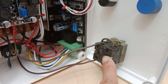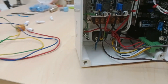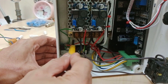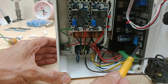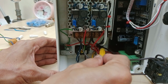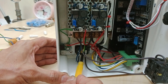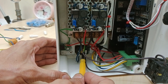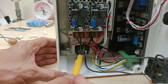This is just a simple switch that turns on and off the AC power from the wall outlets going to the switching mode power supply. The backplate on the box is an aluminum panel, and the metal case and heat sink of the PCB board are all bolted to this aluminum plate, which helps with heat dissipation. All the metal parts are also connected to the earth ground via the center prong of the AC wall outlet and the ground post terminal at the back.